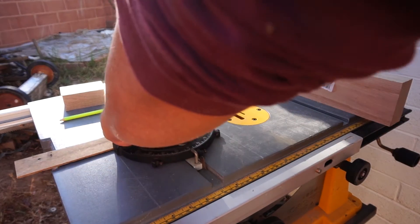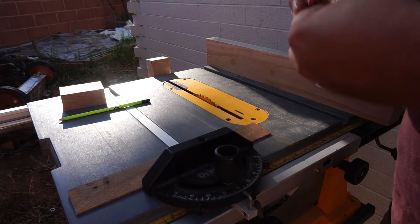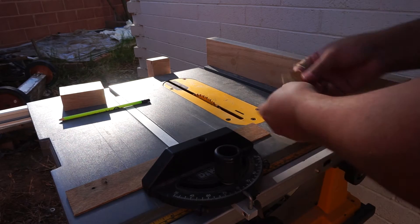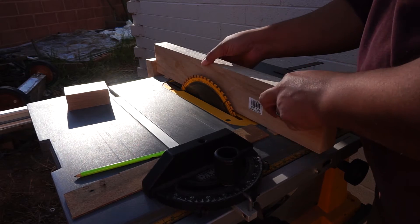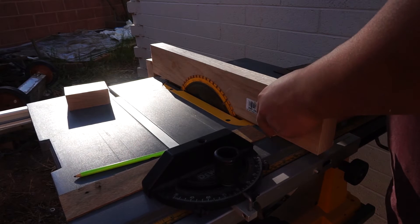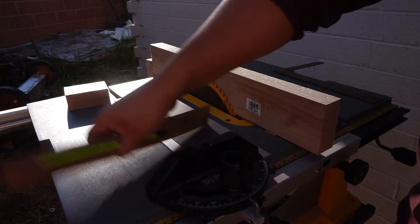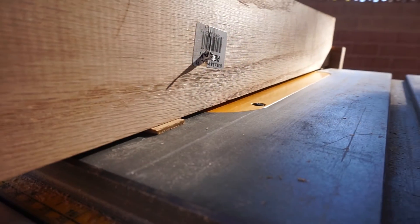Next I cut a few small strips of veneer to set the fence up off the base of the table. I seem to recall the aluminum fence having a small amount of clearance, which is why I did this — I'm not sure entirely that it's a great idea, we'll see how it goes as we get further along. Just rub the strips against themselves to knock off some of the edges and set them out. Put the fence on top of them — I'm doing this at the zero position of the fence so that I've got a guide to keep it straight. And here you can see the offset from the table. I might regret this.